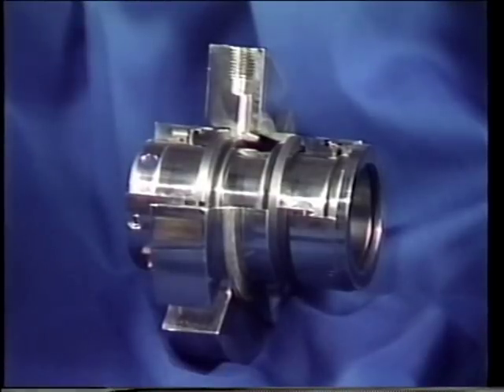The installation of the outside seal was somewhat different from the earlier examples. Our next example is a cartridge seal — a multiple seal with basically two seals mounted in series, each with its own rotating element and stationary element. The components of a cartridge seal are preassembled onto a sleeve and gland plate, which reduces installation time. The shaft sleeve includes a collar, set screws, and an O-ring. The collar and set screws hold the sleeve in position on the shaft, and the O-ring prevents fluids from leaking between the shaft and sleeve.